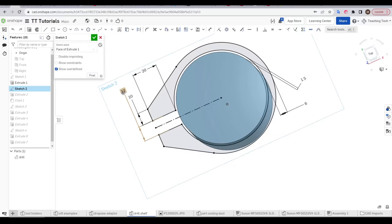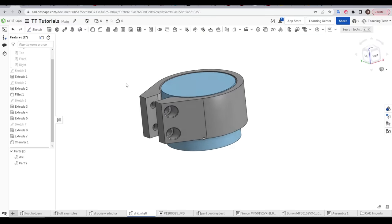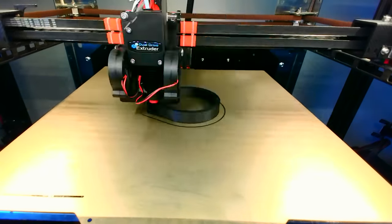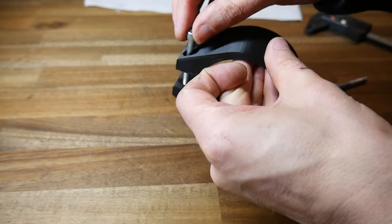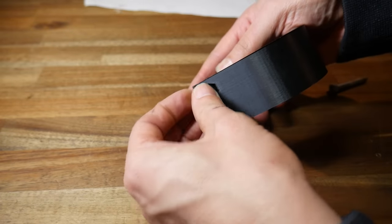At this point I was worried that my clamp opening still wouldn't be enough, so I went back and modified the original sketch to change it — and as you're about to see, that was probably a good decision. Print orientation is as you see, but just like with the design, the slicing is tricky. Normally for a strong part I would have quite a high infill, but for this one I lowered it down just to help the part flex around the outside of the post. Regular PLA is plenty strong for this, and the workshop won't get hot enough for it to deform. We start by test fitting for our trapped nuts and bolts — the bolt slides through nicely with enough room for it to rotate. The trapped nut is also a nice fit.